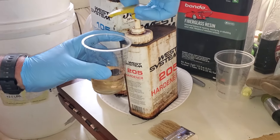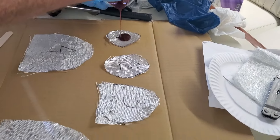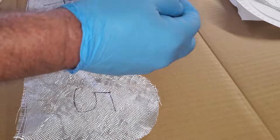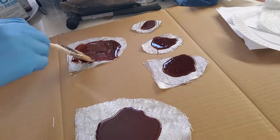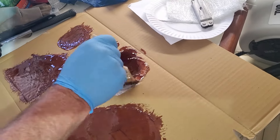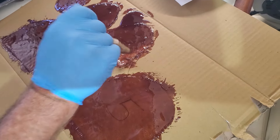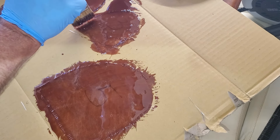Now we're adding hardener. You can go in the center but you can't go on the edges. We've got to get all the way to the edge — I'm saying you can brush in the center, but if you brush the edge, see how it pops up? So you just go back gently like that. Okay, last one — all right.